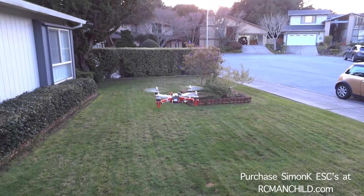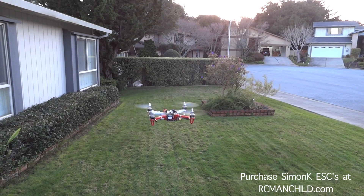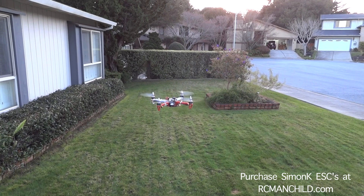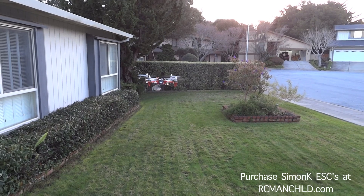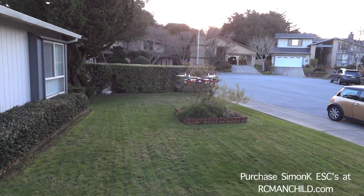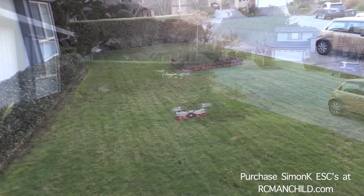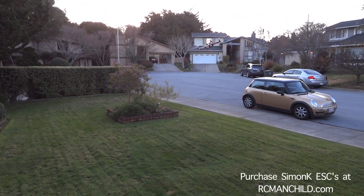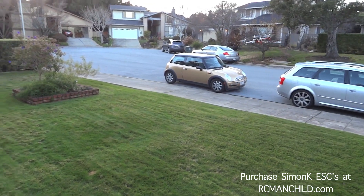Under optimal conditions, flying pretty smooth. There's no unwanted behavior with minor movement, though you can see a little bit of a high oscillation there. I could probably bring the P down a tiny bit, but it'll lose a little bit of its lock. I normally go for a little bit of oscillation as long as it's not enough to throw the direction of the quad. Responsiveness is nice — when I pitch and let go, it still has a little wiggle but it maintains its lock in that orientation.